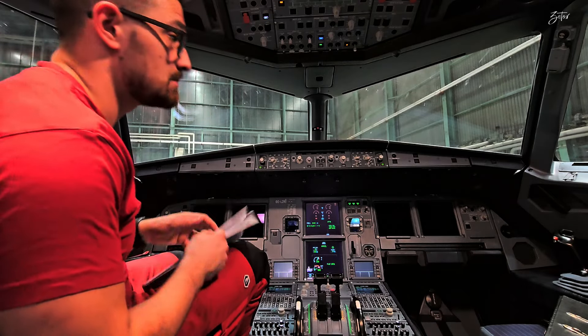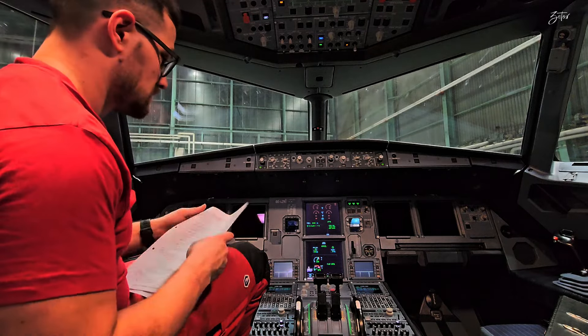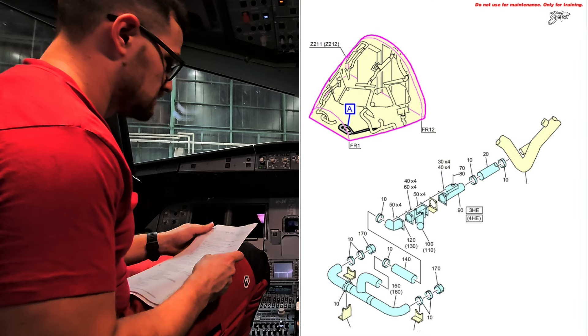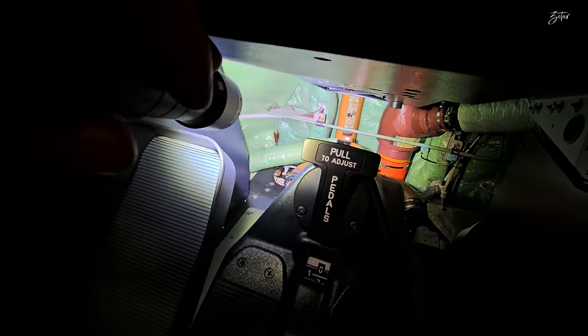For this test I'm gonna need the APU, which is at the moment starting up, and of course I need a bleed system set on. Let me quickly explain why. Actually, I need to have air bleed — these electrical heaters are additionally installed on the existing cockpit air distribution system, which is supplied from the air conditioning system outlet line. From these heaters you can see behind both rudder pedals, and they are here to additionally increase temperature in this area.